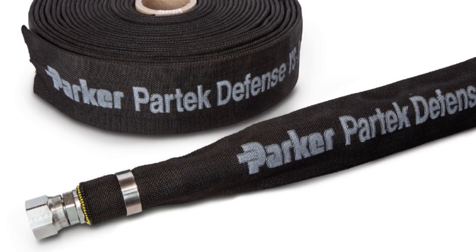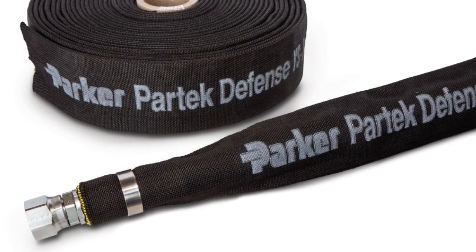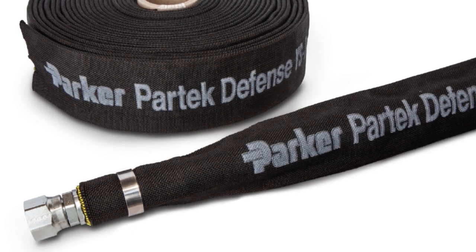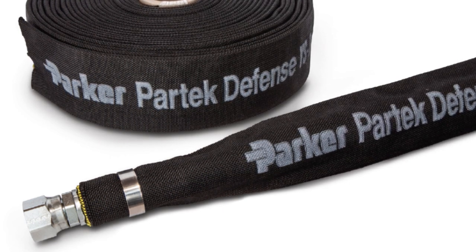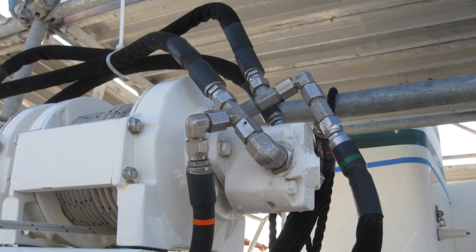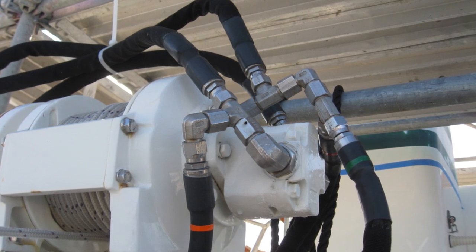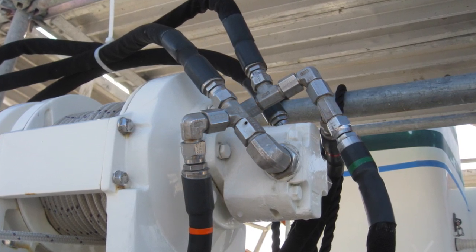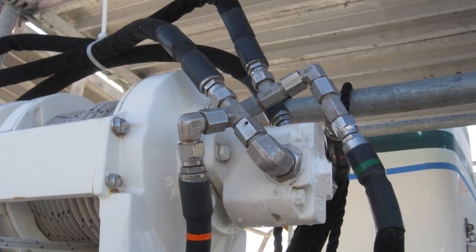Furthermore, hydraulic hoses left exposed to UV radiation will cause degradation and premature failure of the hoses. This will be an even more painful experience if you have invested in stainless steel hose fittings. If you are going to go to the expense and trouble of making up these new hoses with stainless fittings, which will be exposed to UV, then it is a smart investment to sheathe these hoses with ballistic nylon covers.